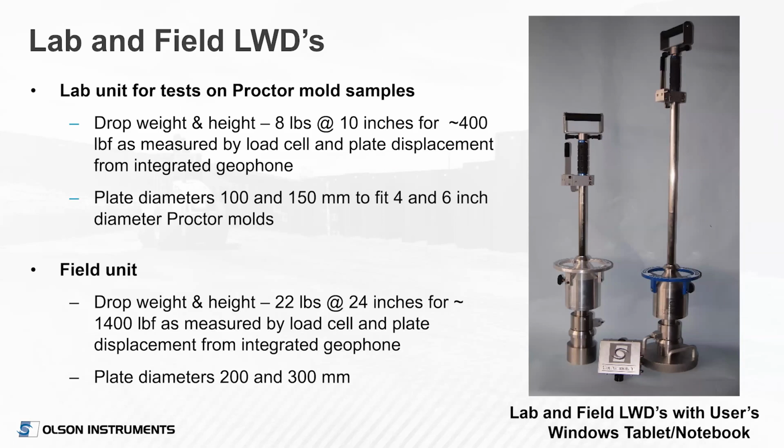So after you do your testing, you would then take it, do an oven dry moisture on the soils, and then proceed. That led us to decide to develop over time a smaller unit to do some stress and strain compatibility matching, because originally the 10 kilogram weight on typical road base or subgrade, depending on the diameter of the plate, was designed to approximate the truck tire pressure that would go through a pavement and be on top of the road base or even the subgrade soils at the greater depth.